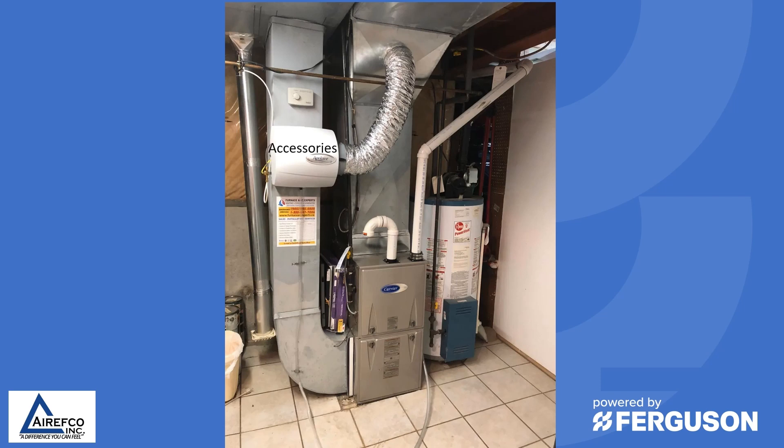Let's take a look at a typical gas furnace installation. I've always said that if a technician would take a picture of the furnace and the surrounding ductwork, I could probably diagnose and tell them what's wrong with the system without even going to the job site. The first thing we observe would be the filters. Most homeowners tell you that they religiously change their filters, and we know that's usually not true. Here's a telltale sign — extra filters sitting on top of the return air plenum.